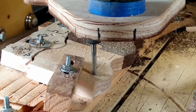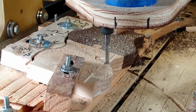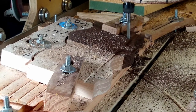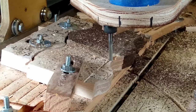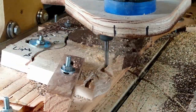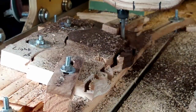Normally when cutting stuff like this I use my dust boot and dust collection, but it doesn't do great video, so I'll just put up with a mess today. If you watch closely, the bit will actually go up and down as it follows that 11 and a quarter degree wedge — it's following that shape. That was an option in the 3D CAD software: you can project a toolpath on top of a 3D shape, and it follows that contour without cutting into the wedge template.